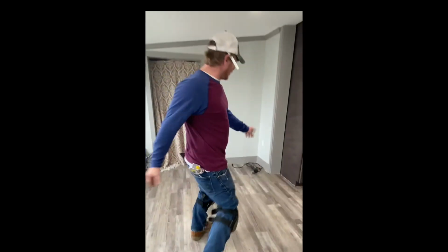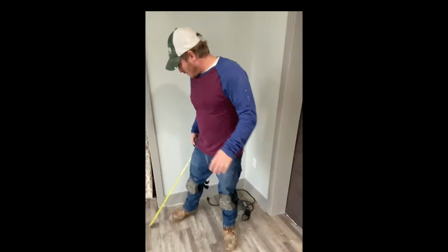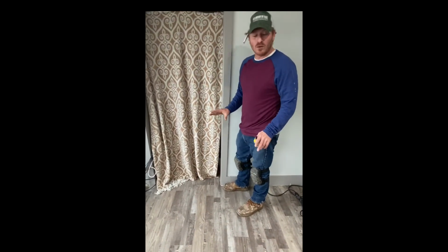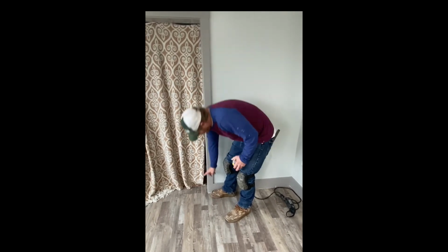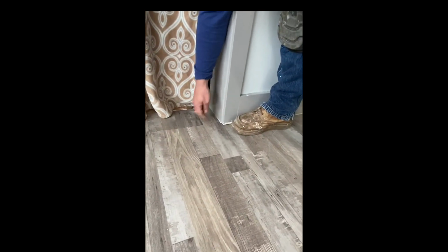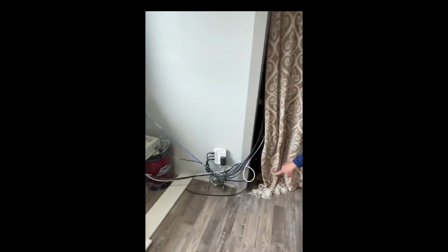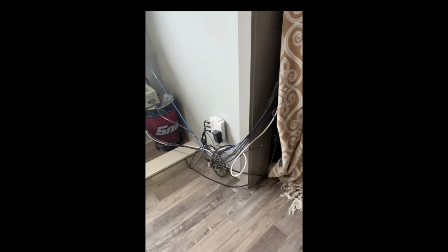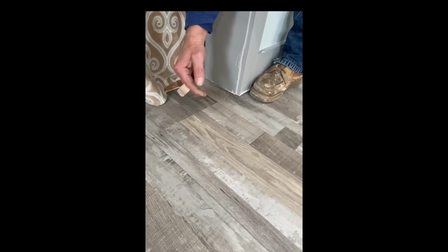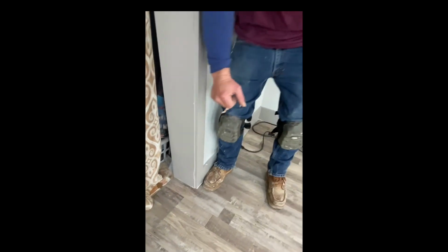Sounds good. And again, guys, you don't want your gaps here, because you don't see no gaps as they're laying the floor here or around your doors. That's because you don't want to see them. That's the finished edge for it. But you cut this piece all the way out. You understand? And you don't go all the way up against that old 2x4 that's in the frame in there. So it gives it room to expand and contract without being against something, as you can see. So you don't never want to lay your floor up against here. You want to make it go under there, but make sure you cut your piece all the way through and get rid of it so that it has room to expand and contract when you put it inside there.